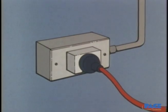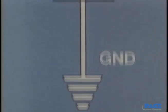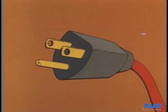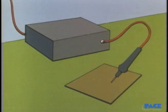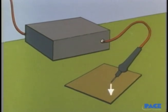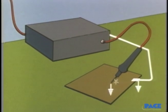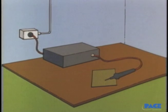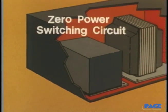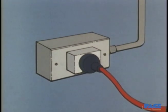The way to do it is by putting the proper filter between the two. Even better, and if possible, prevent the power line from becoming contaminated in the first place. Positive grounding is one of the key methods for preventing electrical damage to sensitive components. Make sure first that your power system is a three-wire one with constant polarity. Then check to be sure that the tool selected uses a grounded tip and is plugged into a power outlet with proper grounding and polarity. In some situations, you may also want to positively ground the workpiece. A separate grounding of the work may not be as safe because the two grounds could be at slightly different potentials. Effective grounding also eliminates the possibility of a voltage leak from the tip of the soldering iron because of improper shielding of the heater circuit.